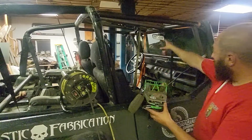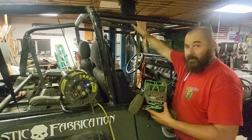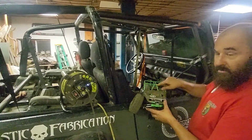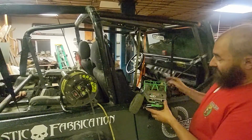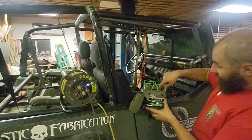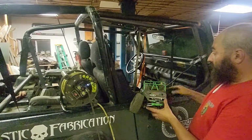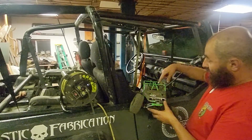These windshield bars, I already said we're going to add in. So the width of these bars is going to determine where these windshield bars are going to start. And I was thinking most guys will run it at an opposite angle than what I have here. I built this, again, based on Ultra 4 rules. So this points all the way down to a node down by the chassis. It angles down just to make sure there's a better node. But we're going to probably angle it outside in.